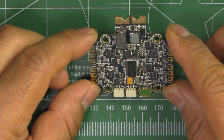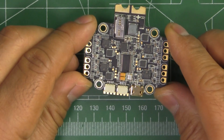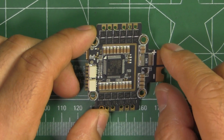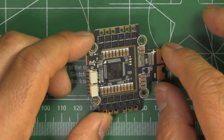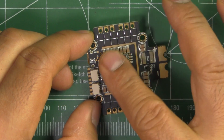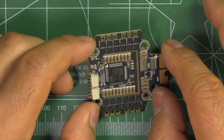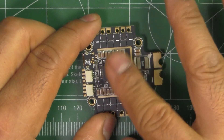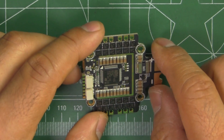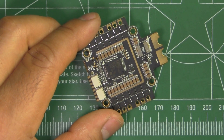It's actually quite good quality on the PCB and the layout. Looks like it's been pretty well designed and pretty high grade — everything's lined up, I don't see any blobs. It's done very nicely. On the product pictures it seems like there's some kind of heat sink here, probably an aluminum plate with a thermal pad, but I imagine they're not including it — possibly because it can shift and you don't want that aluminum plate touching the caps and causing a short. I usually take them off for that reason.